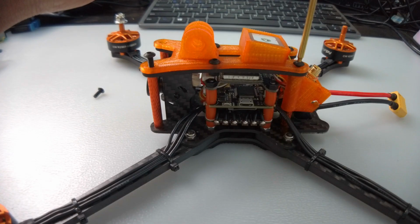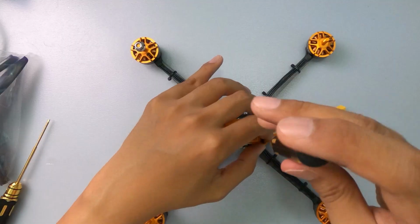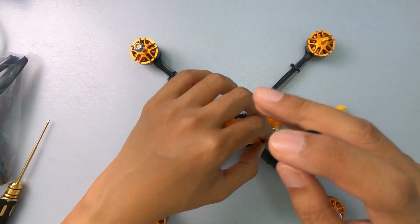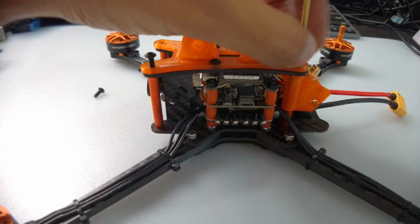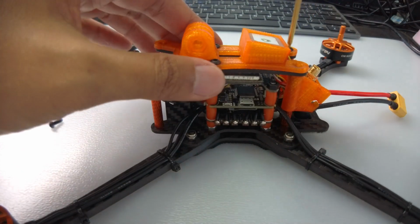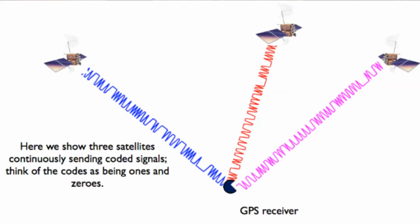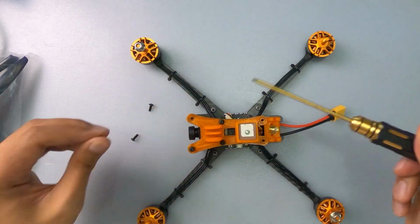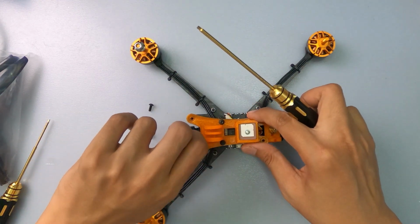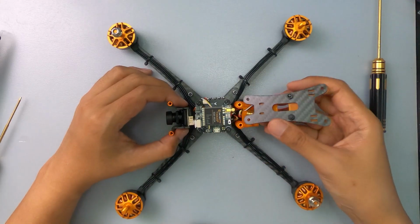While I'm doing this, let's look up what the GPS is. I think it's just a version of another BN200. No, it's not. The GPS is an M80, which actually should give you higher rates of searching, but at the same time, a lot of people complain, I can't get the GPS lock. You really have to be in an open area without interference. This is not a DJI craft where you pay thousands and thousands of dollars. This is still a DIY craft where, okay, it's off.